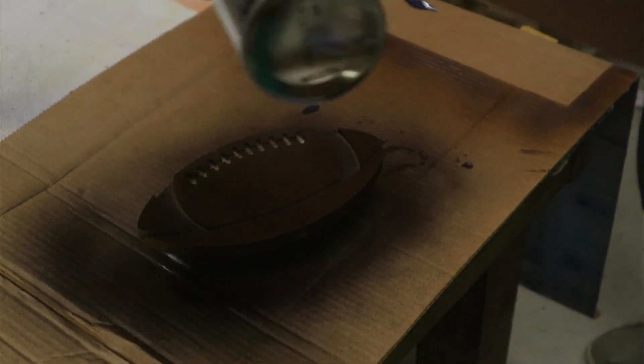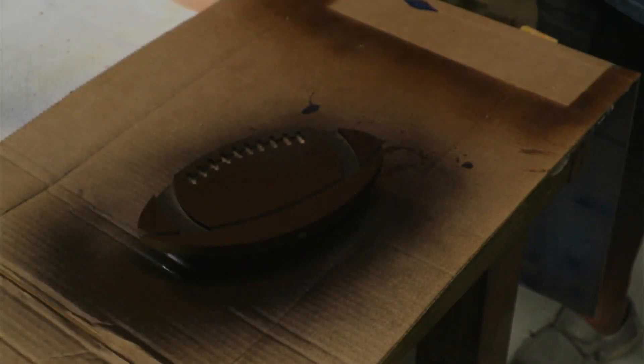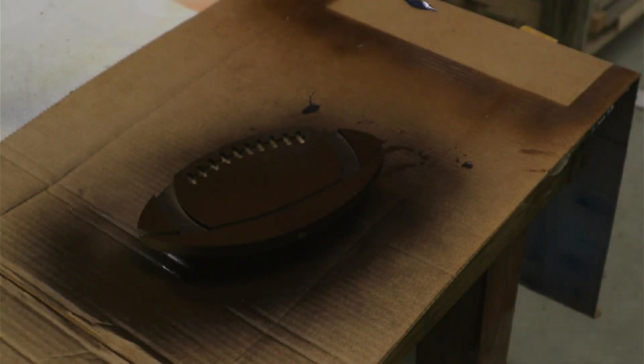We coated it really well. It does take a couple of coats because MDF tends to soak up paint unless you prime it — this is a two-in-one with primer built in, but it's still going to take a couple of coats. We show one coat here but we did put a few more on.